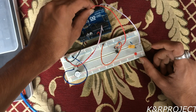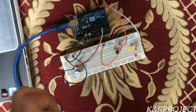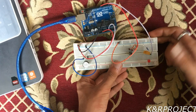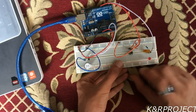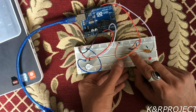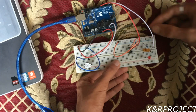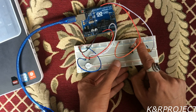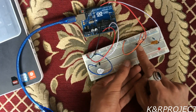I'll be connecting it with pin number 8 on the Arduino. With this our setup is complete. You might be wondering why I use this 1K ohm resistor to ground this push button. When you press it, you send a positive input to the Arduino, but when we don't push it, it sends random input to the Arduino which might affect our program. So when we ground it, the current directly flows to the ground and there won't be any unwanted input — our program runs properly.